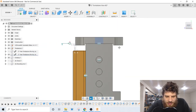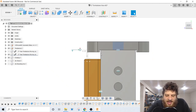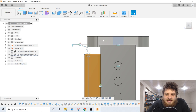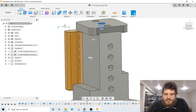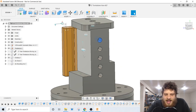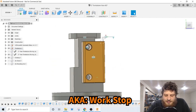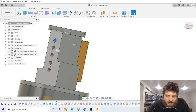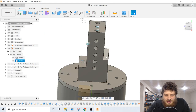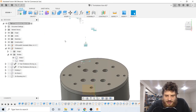The movable portion of the jaw extends down just a tad, and that is so that if my stock is undersized I can still clamp down on it. I have five threaded holes here — these are quarter-20 on the sides. I have those holes there so I can add accessories like vice stops, or I could potentially fixture a part right there on the side.